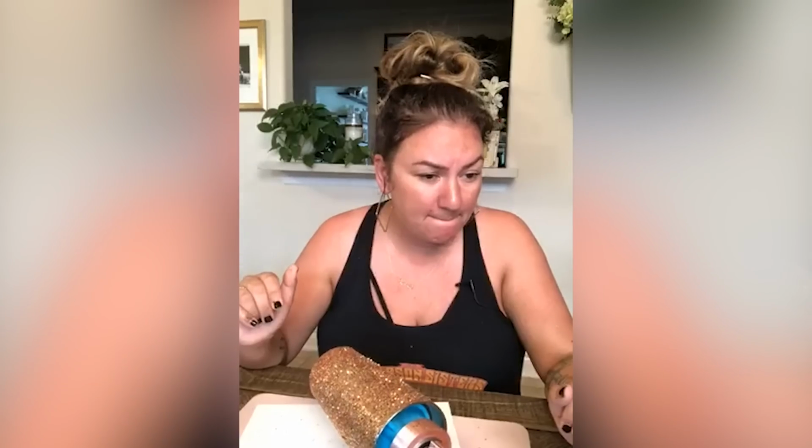In higher or lower temperatures where it's colder, you're gonna want it to turn at least somewhere from 6 to 8 hours, maybe a little bit longer depending on the brand of your epoxy. I know some epoxies take a little bit longer to cure. I live down here in the Houston area, so it's kind of warm in my garage, so I can get away with about 4 hours before I can put on a top coat, okay? All right. You are welcome, Jennifer.